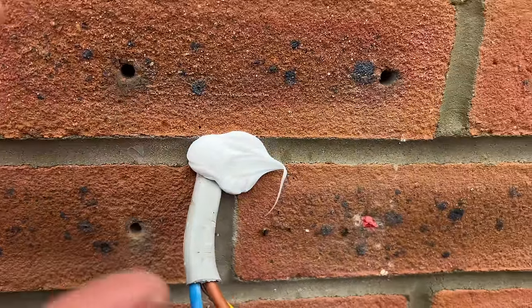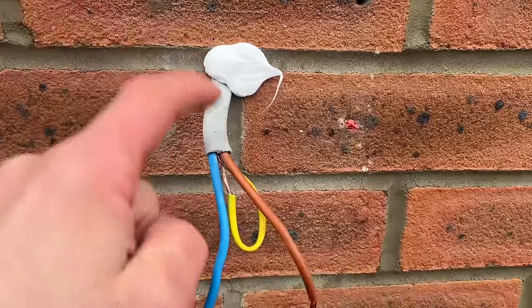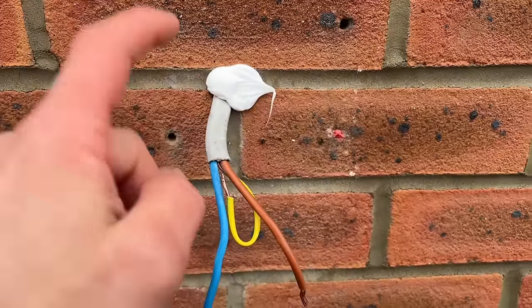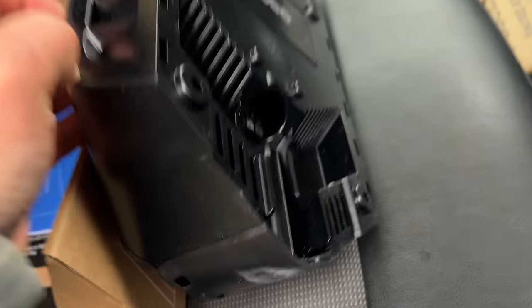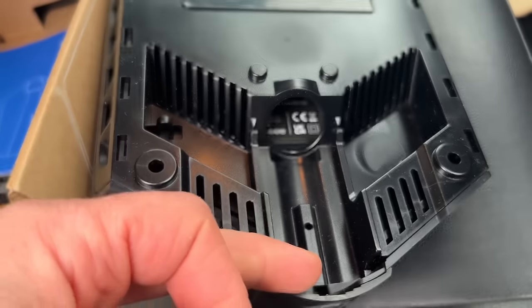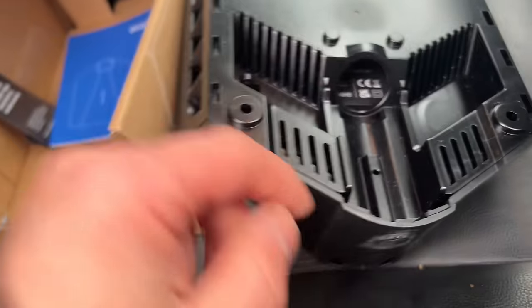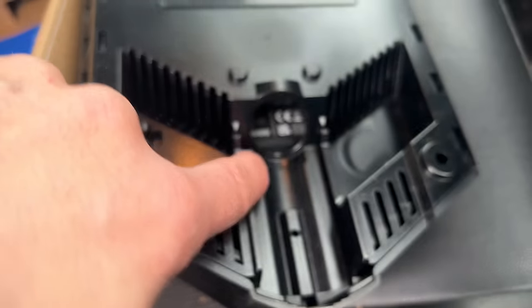We're going to splodge this just to seal it up, basically. Bring these cables into the Easy EV. And this is good. It's in twin and earth, because these EVs are really crap to gland twin and earth in, aren't they? Look, that's all they give you. You can't actually gland. You have to put a whisker and then bring another cable up, which I think's crap. But in this instance, we'll just go straight in there and put the grommet.